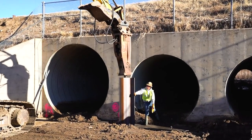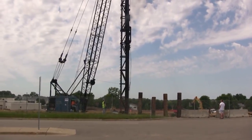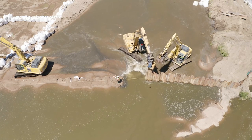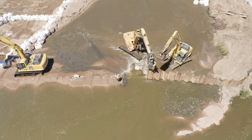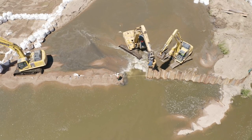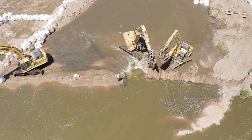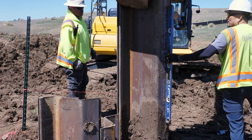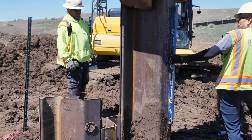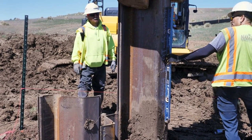In more cohesive soils, we may need to use something more robust like a concrete breaker head or even a diesel pile driver. Partially connecting a few sheets prior to driving them to full depth helps maintain alignment rather than driving every piece all the way in one at a time. This prevents really meandering sheet pile installations that can be difficult to connect to with either a cap or a drop structure. Each individual sheet pile needs to be driven as vertically plumb as possible to avoid putting too much stress on the joints.